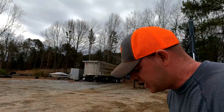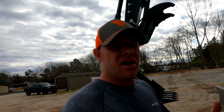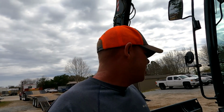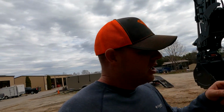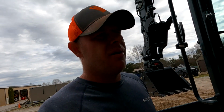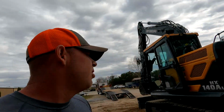I'll try to do a little voiceover later or something, put the specs in there for you guys. One thing about the size of excavator that I have is, I was just talking to Dirt Perfect about this. If you're in a 120 to 140 size, you can get a lot done, close to the same amount of work done as a 160, but you don't burn as much fuel. So fuel and transportation. I think I ran one Volvo 160 before, and that was years ago. But that's what he was kind of saying. That's a good point.